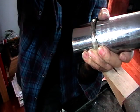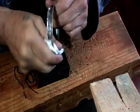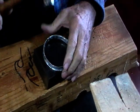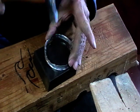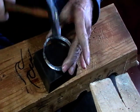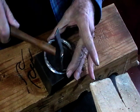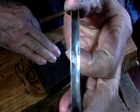Work your way all the way around. When it's nice and pretty and round, anneal it again. Dry it after you've quenched it — I haven't pickled it, it doesn't really matter. Now place it on your bench block or anvil and use the flat part of the hammer to gently hammer the edge, working your way around. When you get a nice curl, flip it over and do the other side.